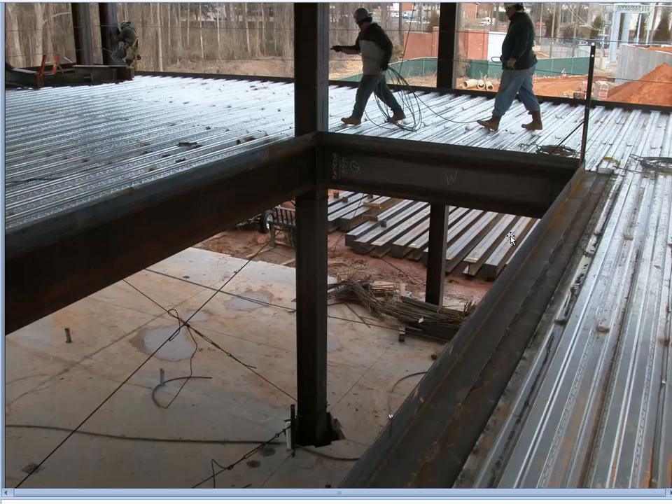This is an interior view. Around this stair opening there is angle welded down to the girders and joists. This angle provides the framing around the opening, giving sturdy steel to make connections to — such as supporting the stairs or supporting wall elements hanging off that edge. It also provides the formwork for the concrete. Here you see the edge angles again on the boundary of the building.